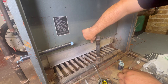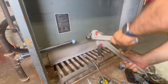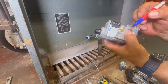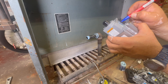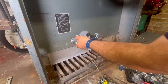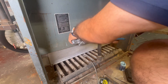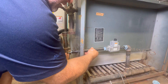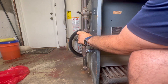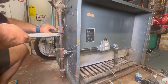I use a 7/16 wrench to install the four screws. Now I'm installing a reducer from one inch to three-quarter because the boiler pipe on the right is one inch and the gas valve goes up to three-quarter. I'm marking my gas valve connectors — PV, MV, and PV-MV — because once the gas valve is installed facing the furnace I won't be able to see the factory markings. Make sure the gas valve is tight but be careful not to overtighten and crack it. Finally, install the union, make sure it's tight, and that's the gas valve done.